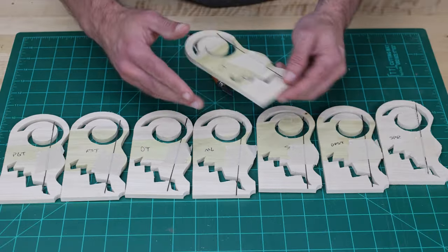Next is the modified geometry blade. This was a fast one, just like whenever I did the wood and the plywood — it just wants to cut fast, and the same thing with the acrylic. The cut was not as good of a quality as the top two. You can see some chipping on the inside edges of the interior cuts, like the swirl and the zigzag. So it is definitely not in the category of those top two, but still did a really good job. Number four is the precision ground tooth blade — really similar to the modified geometry. The cut quality was really good, maybe a tad smoother than the geometry one, but it had more tear out on the backside, and it was too much to make up for the difference in cut quality. So I put that at number four.